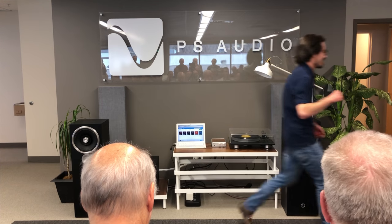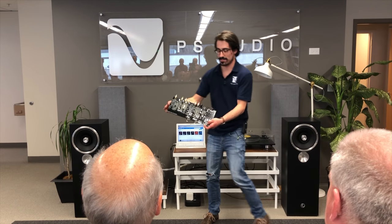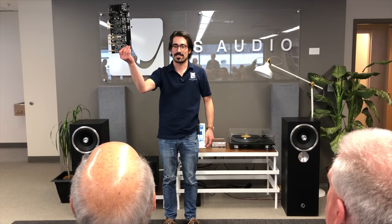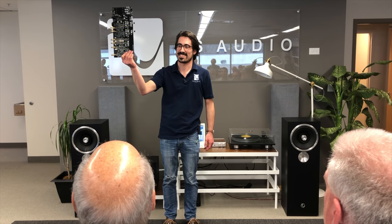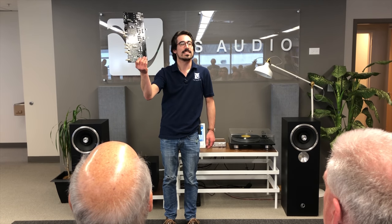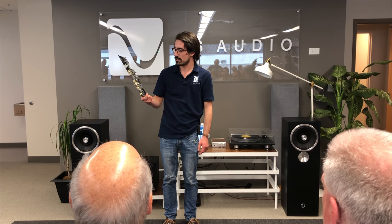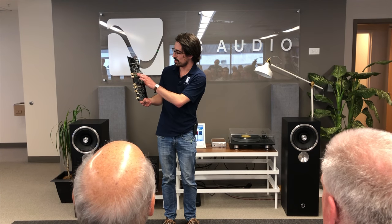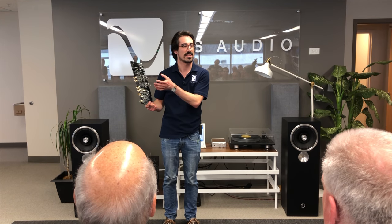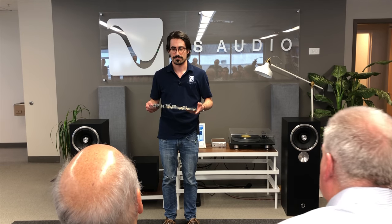And yeah, sure. So this is an early prototype. Not everything's populated, but here's the 700 parts, all discrete. Down to regulators are all discrete. The voltage references are all discrete. It's pretty much just single-ended out. So the op amps that I've created have a large, it's actually not on this board, but if you saw a revision above this, I have large TO220 highly biased MOSFETs, and there's only one device doing the whole waveform, so that's a single-ended approach.